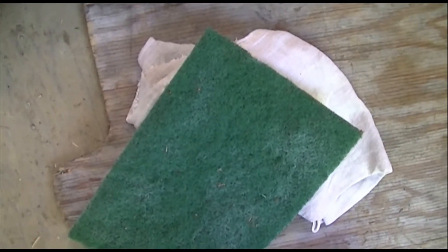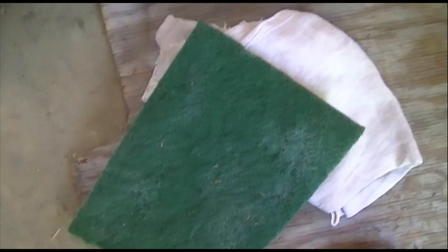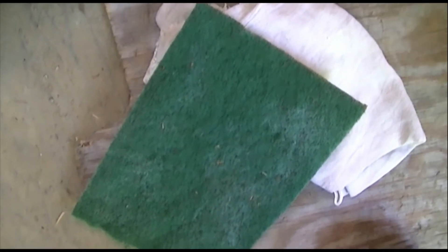If you've got any crust on that nipple on the cylinder fitting, take a scotch brite pad like this and put it in there and clean it up before you put your hose back on. I'm doing this by feel — I got my hand in there with my finger on the bottom side of that fitting where I can feel roughness, and I got a piece of this green stuff in my hand with my middle finger and I'm just scrubbing away at it until I feel it's smooth. If you don't pay attention to these details, you're wasting your time doing this.